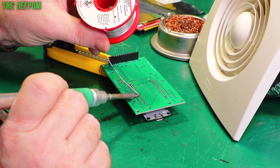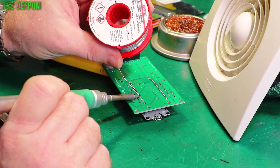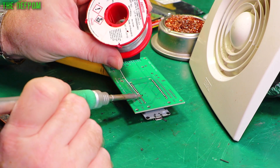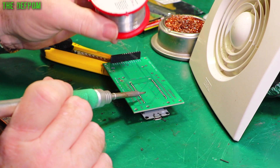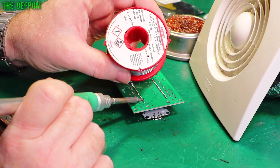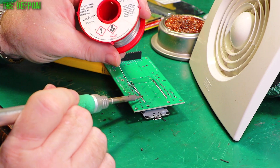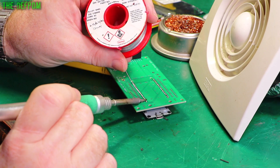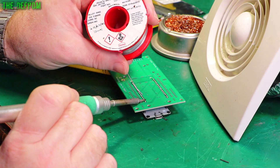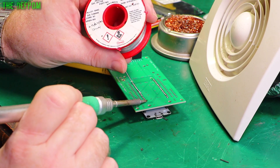There's one modification I probably need to do to this board as well. The backlighting is running directly off the 3.3 volt rail, and that can be controlled by the software in the FreeTouchDeck. I may or may not change that — it's easy to get to, and this is an advantage of having things plug in: if you need to make changes to the board, you can just unplug, make the changes, and plug it back in.